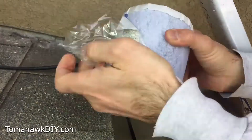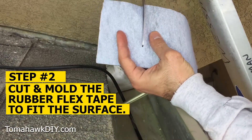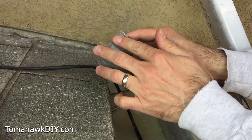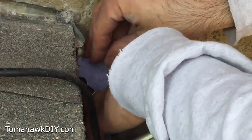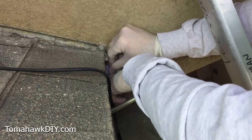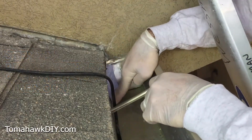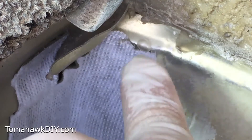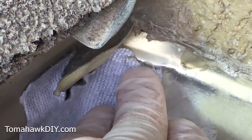All we're going to do is take some scissors and cut this tape to length. We can continue to shape and mold it to however it's going to best fit in our particular application. On the back side there's a release liner that you peel back when it's time to adhere. Be sure you've got it in the right spot and ready to go before you remove that release liner and stick it down. I'm going to apply pressure because I want this secured down good and tight. Look at that air bubble I worked out right there — it was in the adhesive and I didn't want to leave that under, because as time passes and things heat and cool, that could cause some problems.